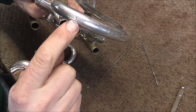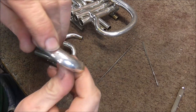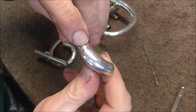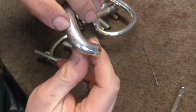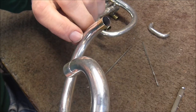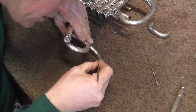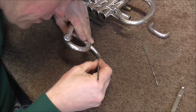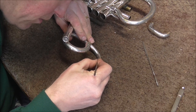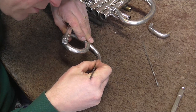I got this crack cleaned up, and I also did these two. When I cleaned up this crack, it developed a hole in the metal — but again, I'm going to fill that up, so that does not matter that much. Now I have the large crack left. It's a pretty big one, going from about there to there. I'm going to do the same thing with this crack, just cleaning up all the junk, so that the solder will stick to it and go where it's supposed to.